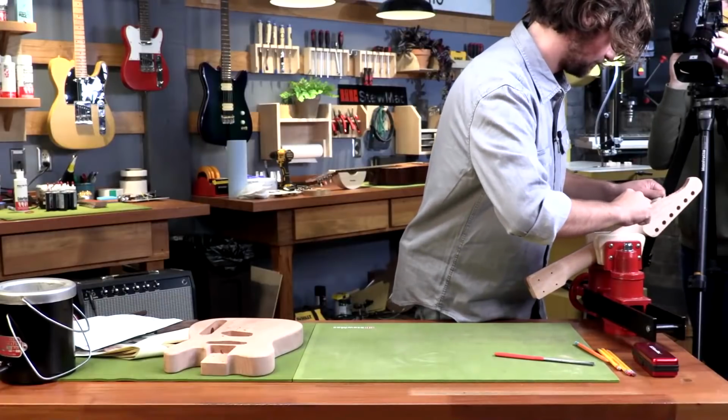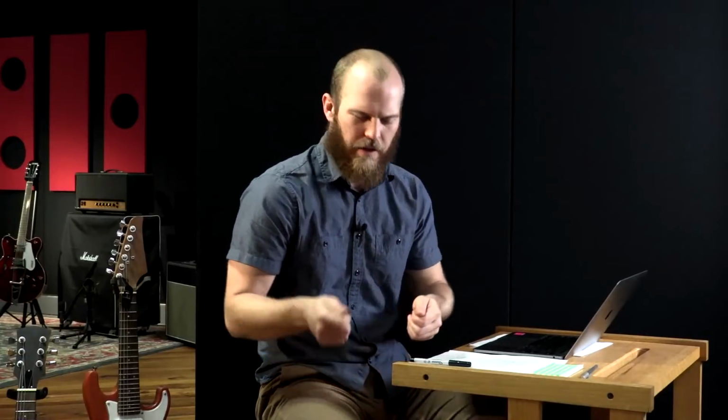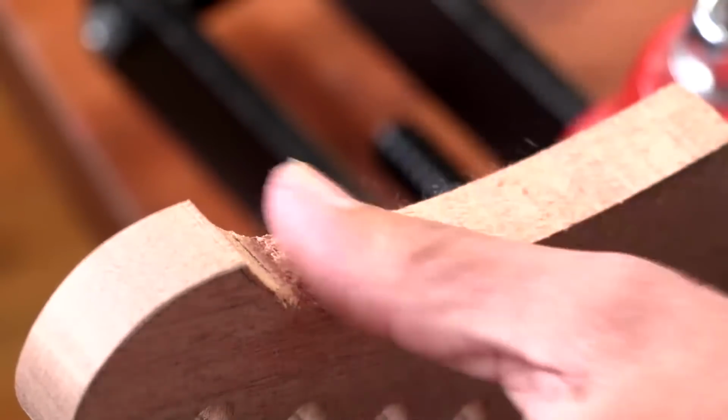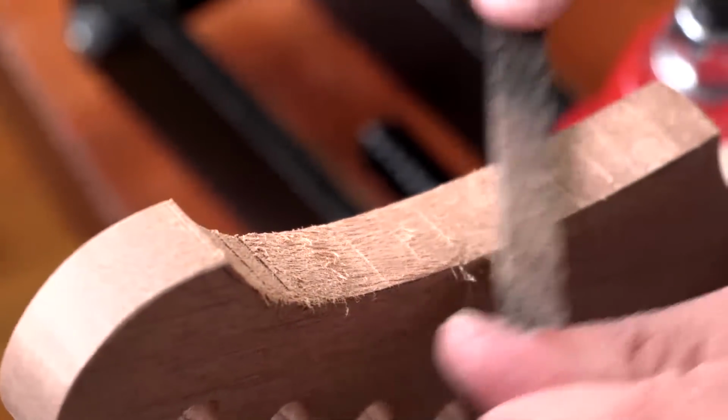Gotcha. And somebody actually did have a question about the reason why you were doing those smaller cuts. So I'm going to just explain that again. Yeah. It's so that the blade can move easier. As you cut to those smaller lines, those pieces will fall away, and it makes it so much easier to control where the cut's going. It's a little bit of a safety measure too. If you've got the blade way into that cut, it could possibly pull the piece of wood in a way that you wouldn't want it to.